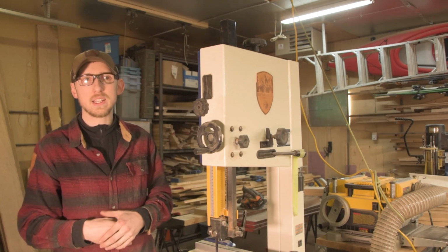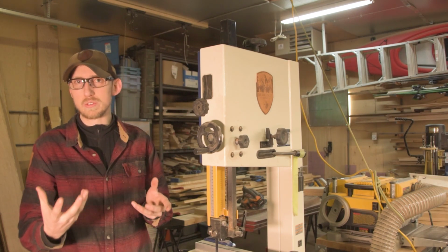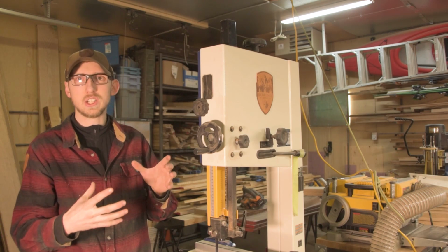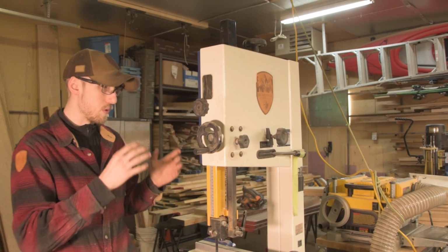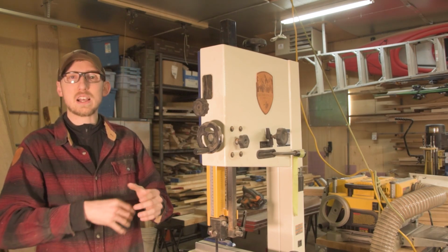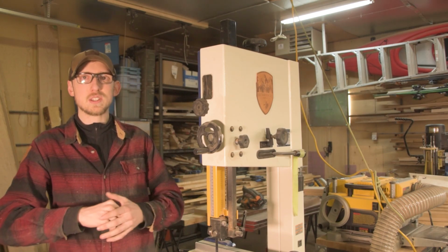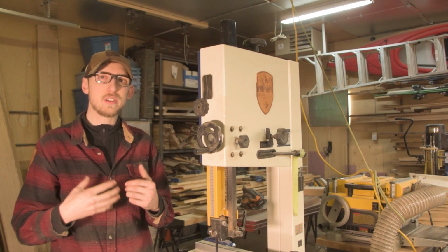And then we're just adding anywhere from 3/16 to 1/4 inch to that. So in all these boards that I have laid out here, I added 1/4 inch excess. So that was to account for the material that I just took off on the jointer there, as well as what I'm going to be taking off on the bandsaw, plus whatever I'm going to need to mill afterwards. So there's a lot of added material there that you have to think about.